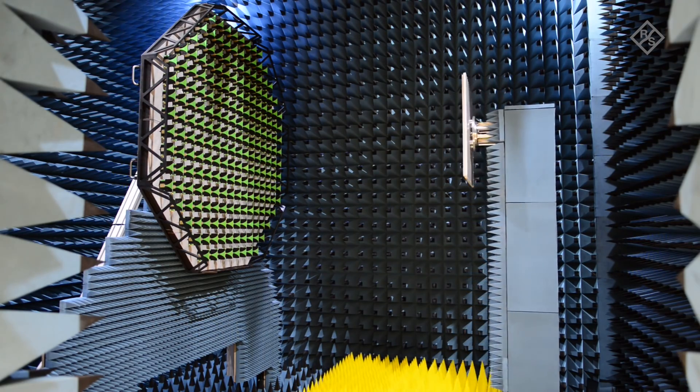I can introduce a very innovative approach that we developed at Rohde & Schwarz — the PWC-200, the plane wave converter. It was made specifically to address the market of base station testing, massive MIMO base stations, sub-6 GHz. The idea is to use a phased antenna array. In the near-field, the field from these antennas looks like a spherical wavefront, but if you use many antennas and combine these fields in a smart way using different phase shifts and different magnitudes, you can combine these fields to create a plane wave at a very short distance.